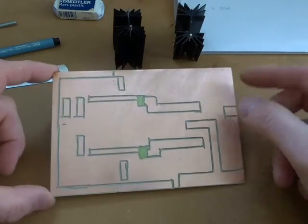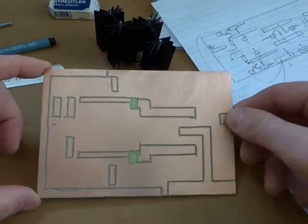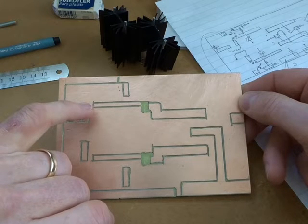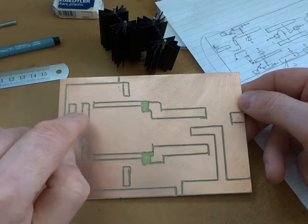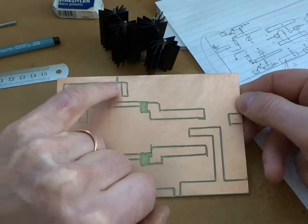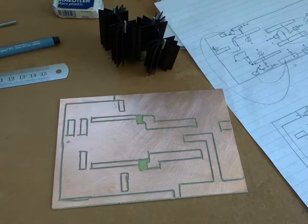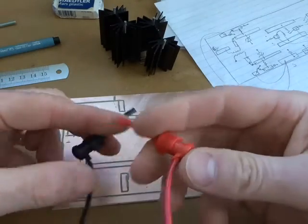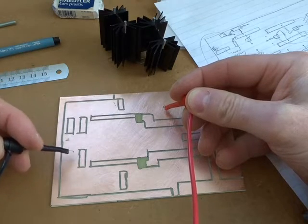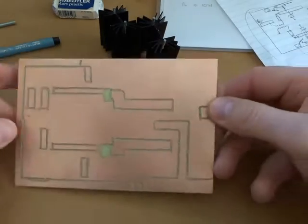I got that copper board we discussed in the last video, and what I've decided to do this time rather than cutting out pieces of copper and gluing it on, I've elected to use the little Dremel — first with a disc cutter to cut the straight lines, then with a very small ball cutter to round off the edges. Then I used a multimeter in continuity mode to test for any shorts, making sure there were no little micro shorts that can be very hard to see. That was a nice easy way to confirm everything's been isolated.